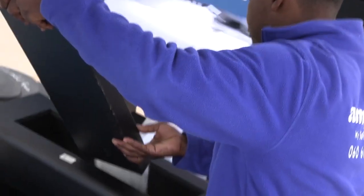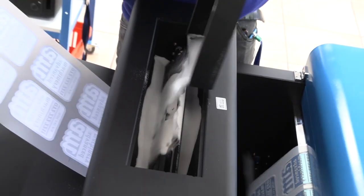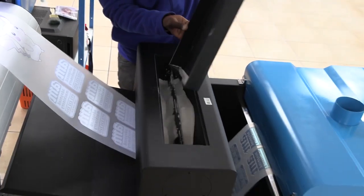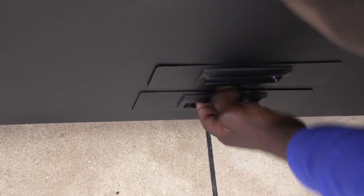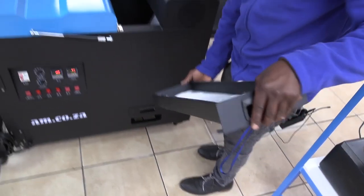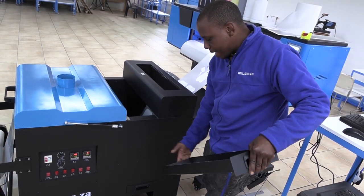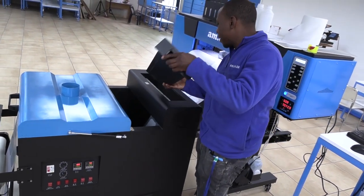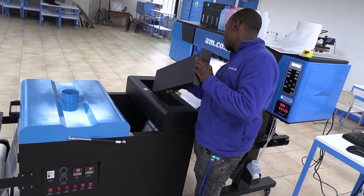This unit comes with two trays to catch the powder. When the powder becomes less, I can pull out the tray with the powder and top it up on the top platform — this just cycles the powder. With my first tray in, I can now pull the second tray out. It catches the other excess powder when I remove the first tray, so I can avoid powder going to the base of the machine.